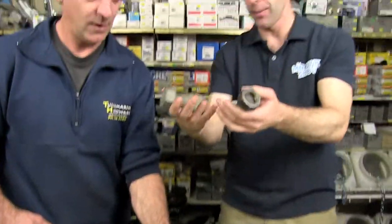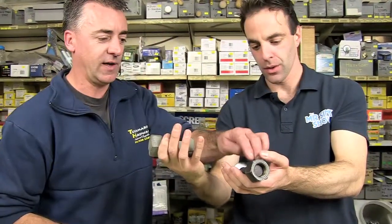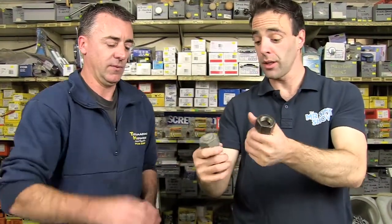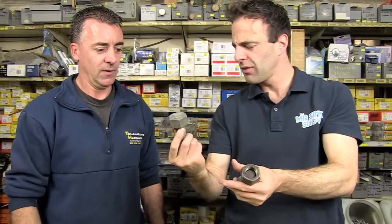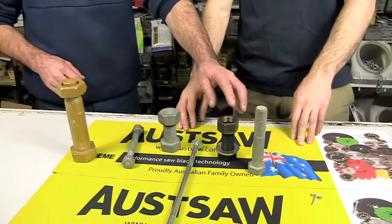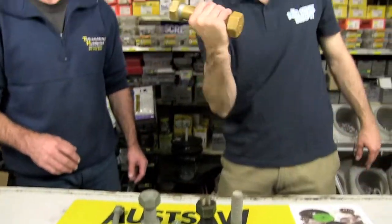There are different materials. They're all steel — but that one's a high tensile bolt, a lot stronger. We're talking heavy machinery, putting engines together — about three times as strong as a regular bolt. That one's galvanized, and this is black steel without galvanizing. For a tow trailer you'd use galvanized bolts; on machinery you'd use black steel high tensile. And this large one is actually a pin out of a heavy shackle — it still acts as a bolt though.